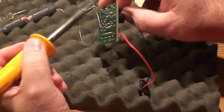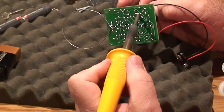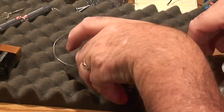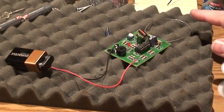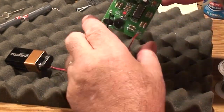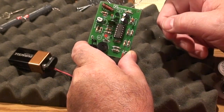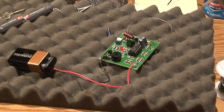Trace your leads on the bottom so you get the right one. Okay, take that capacitor off. Now plug this thing in — when you touch it, you can see the LED will light up and the speaker only works as long as it's being touched. There you go — simple and easy.